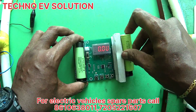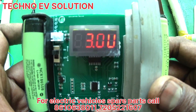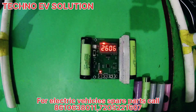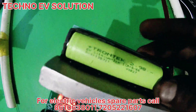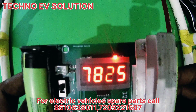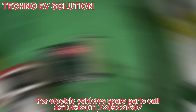Next, the Trontex EV-grade cell is 2.98Ah. Our capacity test is set from 4.2V down to 3V. The capacity test also checks 2.6V. We can see the 4.2V to 3V test, but at the extreme level it goes to 0.2V, and the battery reads 0.0V. Our result is 0 in that context.